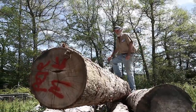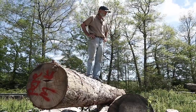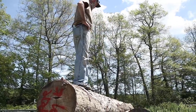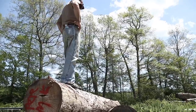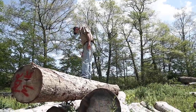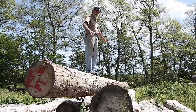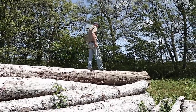I'm standing right on top of this log pile — not something they let everybody do. Climbing around these piles can be very dangerous; if one of these logs rolled over you it would make you paper thin. I've been around these mills so often that they feel it's all right. Now this is the log I've been looking for. It's got that big, heavy, scaly bark on it. Unlike a lot of Quercus alba, I believe this is a swamp white oak — very good material. You can see the bark is much tighter with much smaller scales on some logs, so there is a difference in white oak logs.